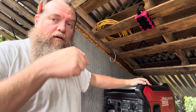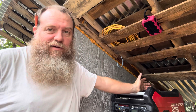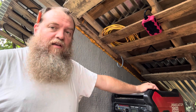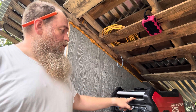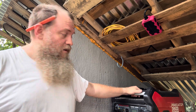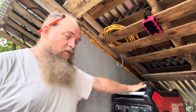Sometimes you have spares for a reason — sometimes one goes out. This bottom bigger generator, which we use more regularly, actually quit working on us a while back, but it was simple: it was just low on oil. If you don't know, these Predator generators have a low oil sensor on them and they won't run if they get low on oil. I just changed the oil out and put new oil in. I have another video on getting this one to run because it would not start and I had to replace some sensors. If you have one of these Predator 3500s, it's a pretty easy fix — but the typical issue is the low oil.